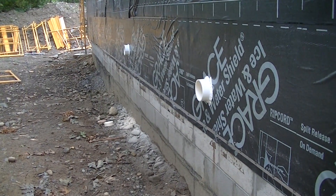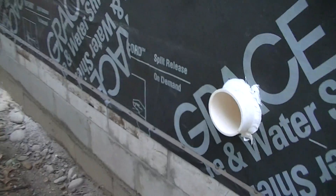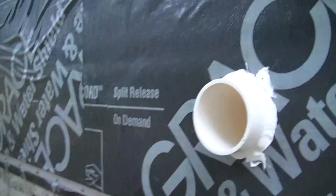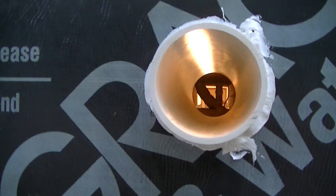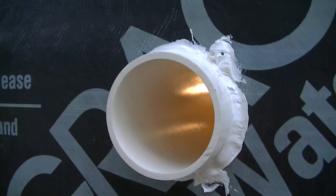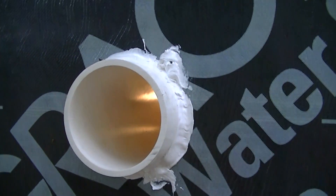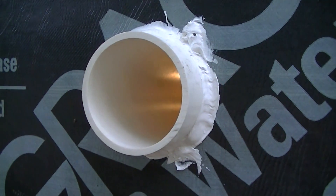This is the back side of the house and these are 4 inch PVCs that I'm using for my HRV, my heat recovery ventilator. I cut out as small a hole as I could and then caulked around it. There's another layer of spray foam on the inside and then another bracing for this so that hopefully it doesn't move at all.